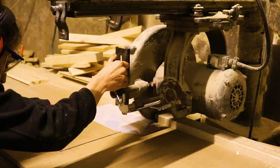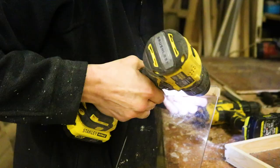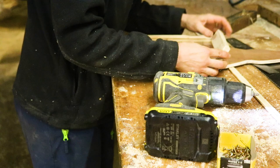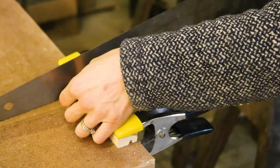Another thing to keep in mind is that the beer bottle caps may drop outside because the nails are so short. So I drilled and screwed an angled piece of wood to the top of the Perspex. I also tried a little Perspex lip to retain the beer caps by the time they got to the bottom, but they just bounced out, so I had to hand saw some slots to create some Perspex dividers.